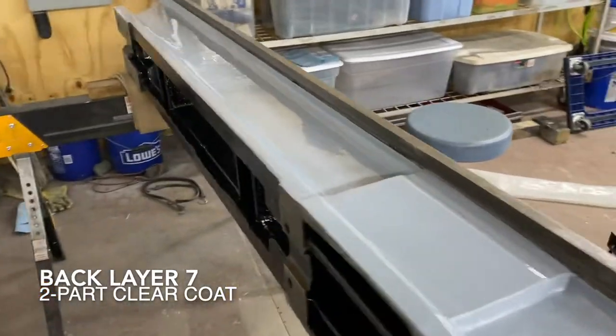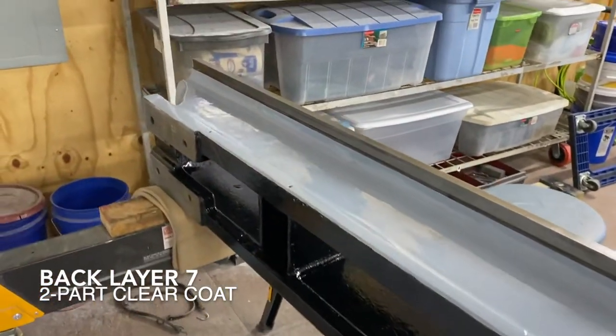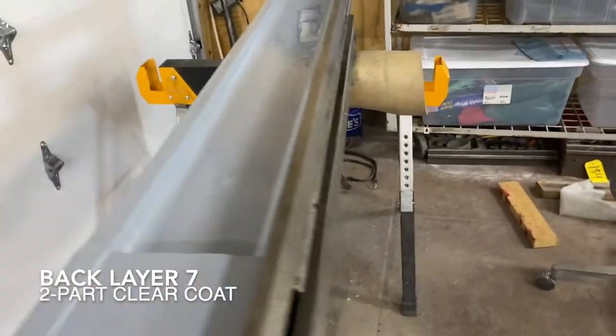There are some marks from where it was on the other side. When I did the black I had a few little things that came through — looks like I need to do a little bit of repair before I can finish this side. I was able to very lightly sand and get that black pigment off — it really didn't take much. Then I lightly touched up with a very small paintbrush, hit it with a heat gun, then came back and put a coat of clear coat on. Didn't get any wrinkling — I'm not sure quite why, but I kind of thought I would. So I'm happy. I've got a second coat of clear coat on here. When I mixed it up I had some extra so I put a little bit on the inside there.